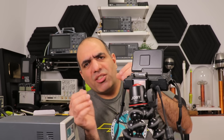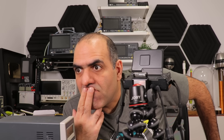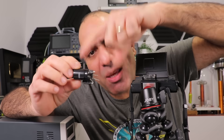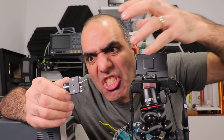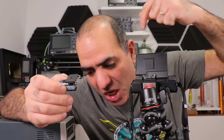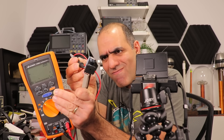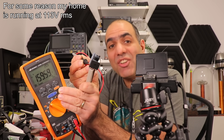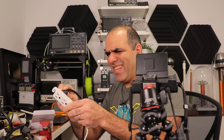There's too much cooking going on here. I think the water should shoot out quickly and get out of the way before it boils. You know what can make it shoot out faster? Higher current, which means higher voltage. Here's an old friend — the full bridge rectifier with a giant capacitor at the output that can create 170 volt DC. Let's connect it up. We have around 160 volt DC at our disposal. Let's plug it in.